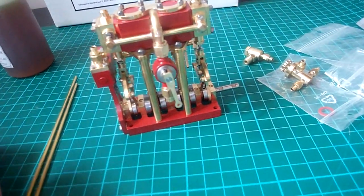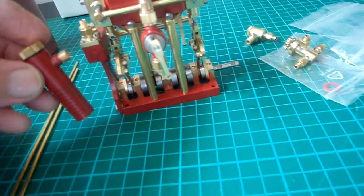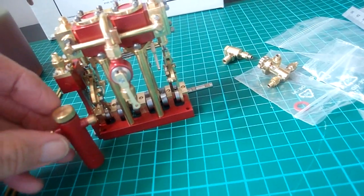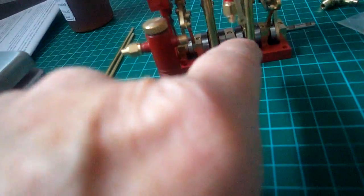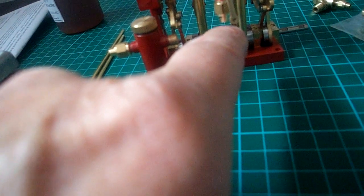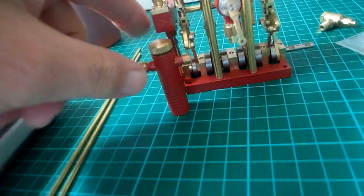And then this is Fabrice's oiler for the steam oil. And that'll go somewhere like that, and the pipework will run to the bottom of the steam regulator — like a little elbow bend there. So I'll pipe that up.